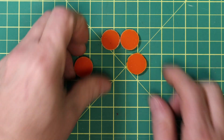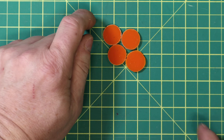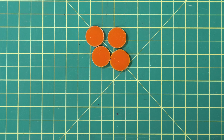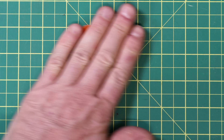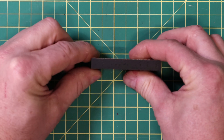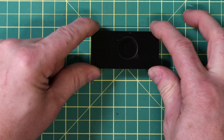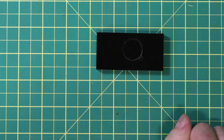I focused mostly on cutting. I started with some acrylic — diode lasers are kind of notorious for not being great at cutting acrylic, but if you get something that's a little darker or off-white, it'll cut just fine. These are all one-pass tests, by the way. This is a nine millimeter piece of black acrylic and you can see in one pass it just carved right through. It was pretty amazing.